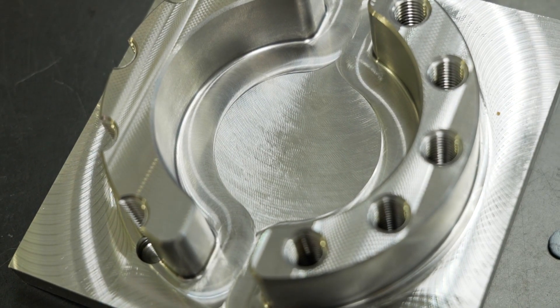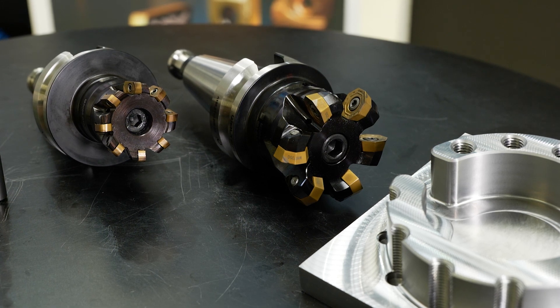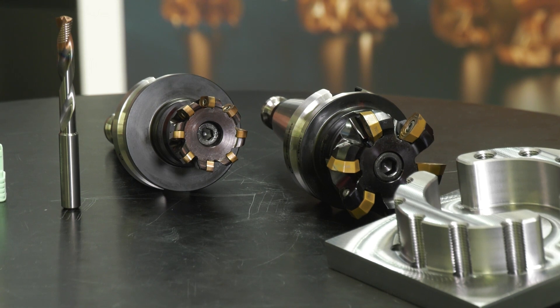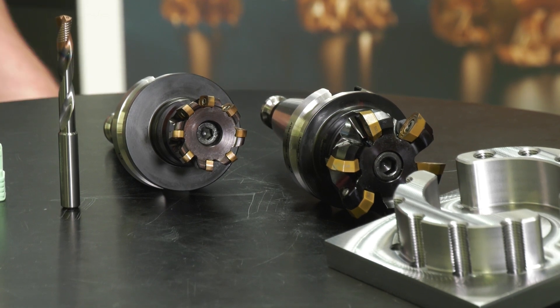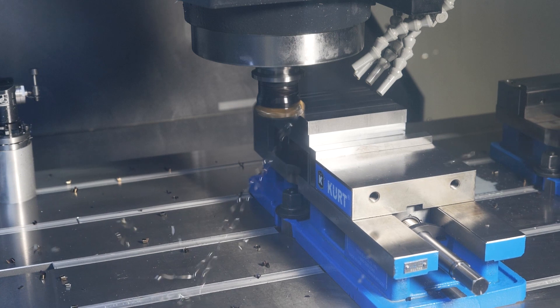We start with a face mill. These two mills — one the face mill, one the high feed cutter — are part of our new ExtraTech XT program. What we've done is increased insert seating surfaces, increased the cross section of the inserts, while keeping the approach to the workpiece exactly the same. That allows a much stronger, more reliable, process-secure tool so we can really ramp up the feed rates.